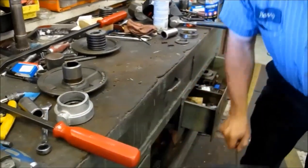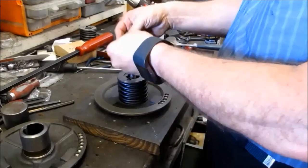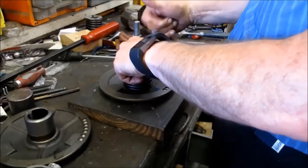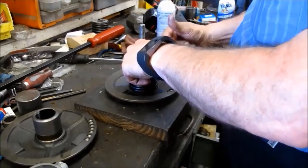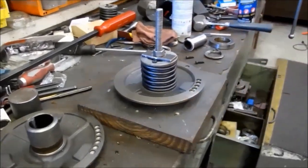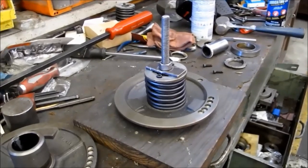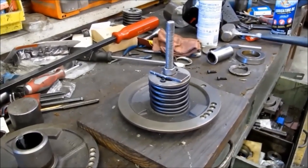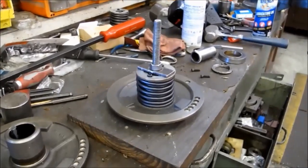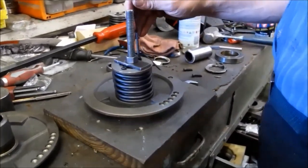For the motor, you are very well served if you build yourself a little fixture like this. You can take your disc and put it on here. Once you have it set down, take your wrench and take your socket head cap screws out.